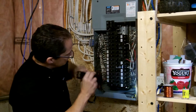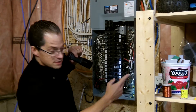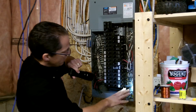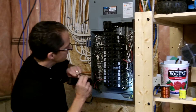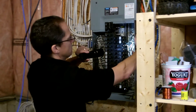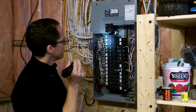Scanning to the back, looking for any loose, dangling, or abandoned wires in the panel — there are none. If one were to get nitpicky, you can see in this panel there are some wire connectors. Technically speaking, those should be outside of the panel; you should not have connectors inside the panel. Not a big deal and I don't think I would note it in a report. Checking the strain relief to make sure that everything is solid. There are no unprotected panel openings at this panel — and we're done. That's an electrical panel inspection.